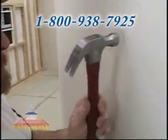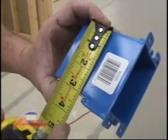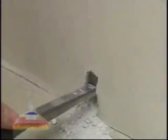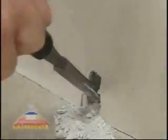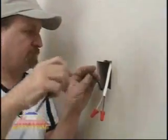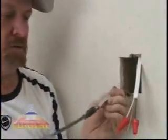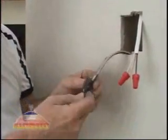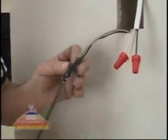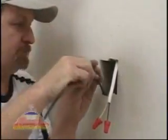If the drywall is already installed, locate the stud, mark its location, and cut a hole for the electrical box. Cut another opening directly below the control location. Feed either the fish tape or a string weighted with a nail down to the hole. Retrieve the end and attach both the power lead and the sensor wires to the string or fish tape. Pull them through the wall and out the top hole. This is much easier to do before installing the electrical box.